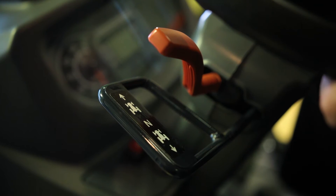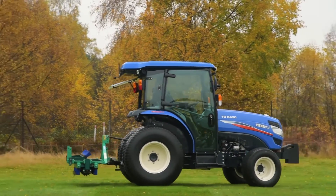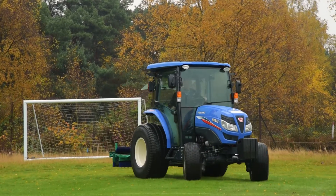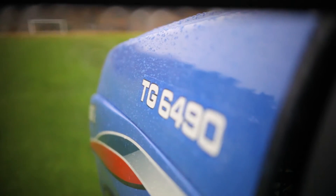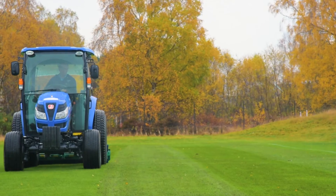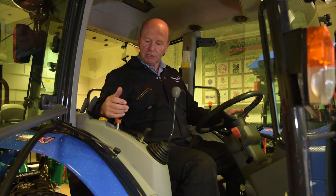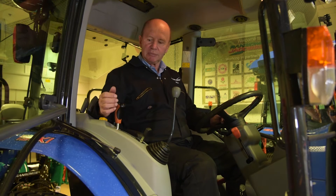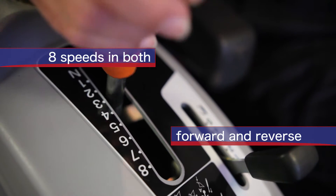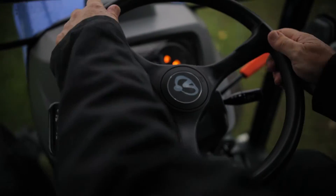If I push it forward when the tractor's in the selected gear it will move forwards. If I pull it back to neutral the tractor will stop. I pull it backwards and the tractor will go in reverse — so I do not need to touch the clutch at all, making it very useful for loader work in those particularly arduous conditions of going backwards and forwards, which many years ago meant clutching and declutching all the time. To my right I have a control which gives me my eight forward speeds. Rather than fighting through a transmission gate, a gentle push forward and I'll be in speed one, two, three, four and so on right through to number eight — extremely easy driving for the operator.